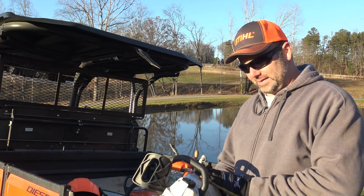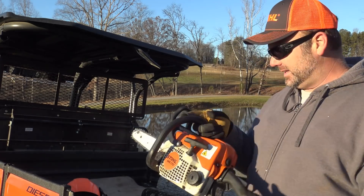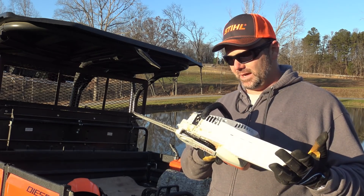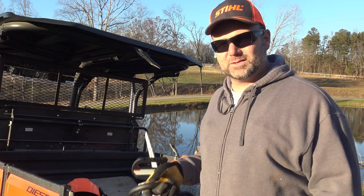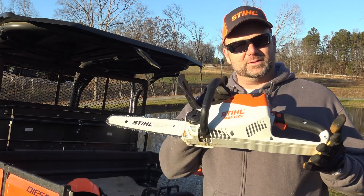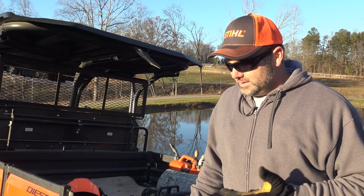I totally stand corrected on this little MSA 140C. When I was working on the tree over there, I'm so used to using a gas chainsaw that I didn't think about how hard I was pressing up against it to cut. If you just let the saw do the work, it kicks butt — and it does kick butt. The chain on the MS 170 was a little bit duller — not a brand new chain like on this one. I'm going to say it did a great job and I'm pretty impressed. It was being a dog only because I was dogging on it. You can't really dog on this saw like you can a gas-powered saw — that's a point to consider.